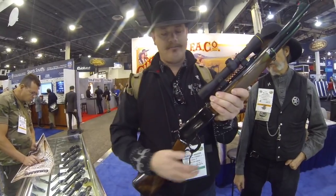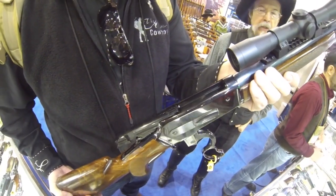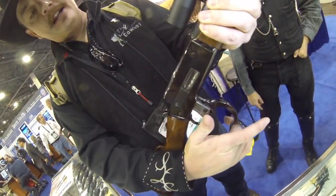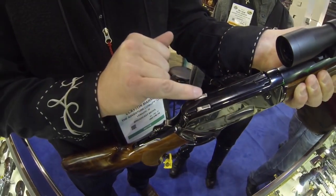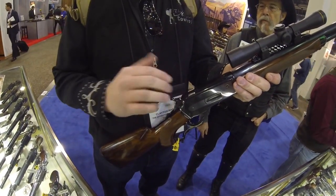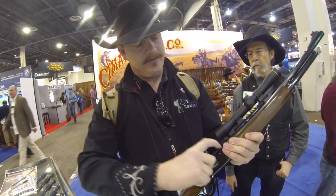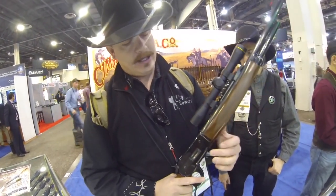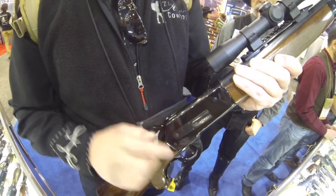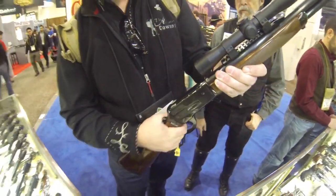This action is based on John Moses Browning's 1886 — essentially it's exactly the same action. It's got these two big massive locking lugs on either side of the lever, and as the lever comes forward it fits in these — it's like a mortise and tenon. The interesting thing about that is prior to this design, the lever actions — in order to shoot a cartridge like the .45-70, which is long — the action had to be so long. So in order to make a large caliber rifle that could handle large cartridges, he came up with this design. And it is the 1886 design from John Moses Browning — Winchester made this as the Model 71 in the '30s.